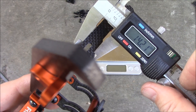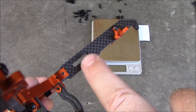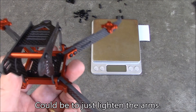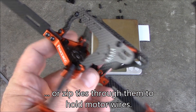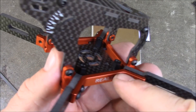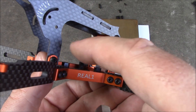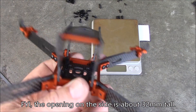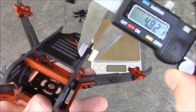These arms are about 4mm wide and 14mm tall, and they have a hole in the middle which I'm assuming is for running a strap through to hold the ESC onto the arm vertically. A lot of people will probably use a four-in-one ESC so it all sits inside the frame. That's also probably why they gave you three sets of spacers: one for the bottom, then your four-in-one, then another set of spacers with your flight board, and another set for your VTX or receiver up top.